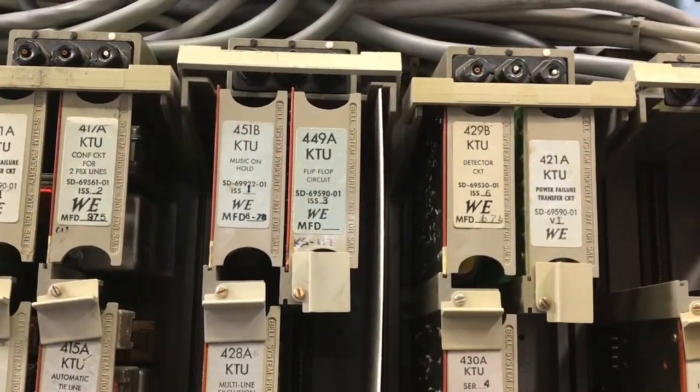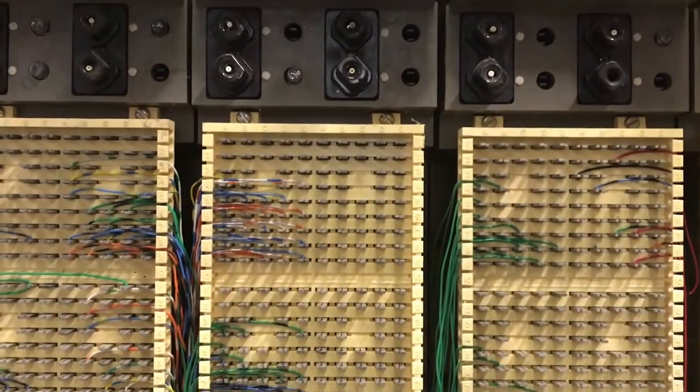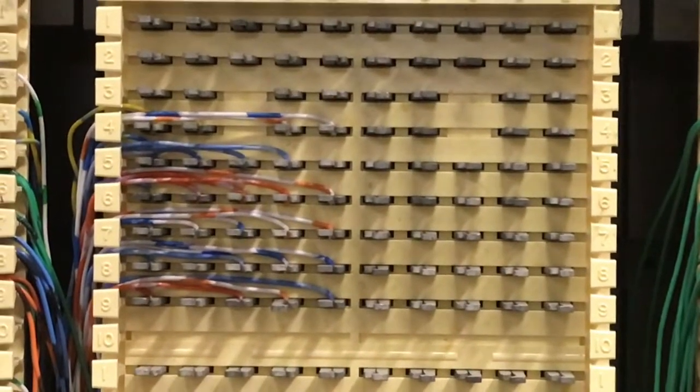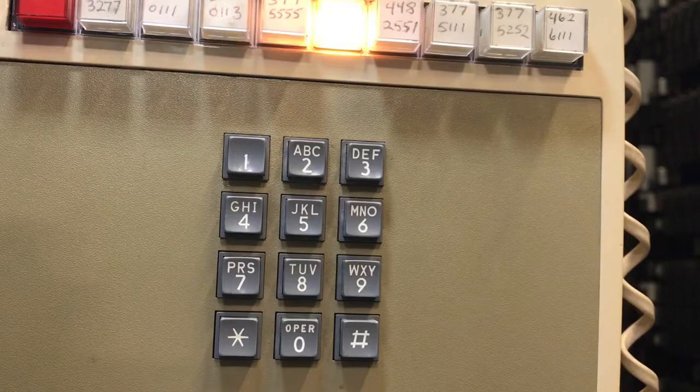I have one 451 card installed in a 642 panel. We're looking at the wiring of the upper quadrant of the 642 panel for several circuits of music on hold in my system. I have a line on hold with a lot of phones connected in my building and a couple of other buildings on the property. I've turned the radio source off so we're still on music on hold without an audio source — and that clicking you hear in the background is the noise on the system. The more phones and the more cable plant, the louder that noise would be.